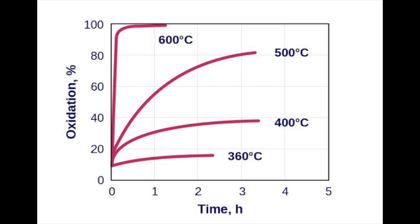This graphic shows how various temperatures will oxidize or burn the soot from your tractor's DPF. You can see that at 600 degrees C, virtually all soot is oxidized from the DPF. You can also see how lower temperatures oxidize the soot much less effectively. When you operate your tractor with low loading conditions, low RPMs, and low speeds, the DPF outlet temperature can reach perhaps 150 degrees C. As the previous graphic would indicate, none of the soot is being oxidized in this scenario. By comparison, tractors operating in high loading, high RPM, high speed conditions will have the DPF outlet temperature reach between 400 and 500 degrees C.